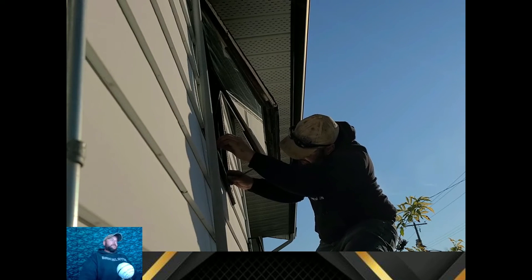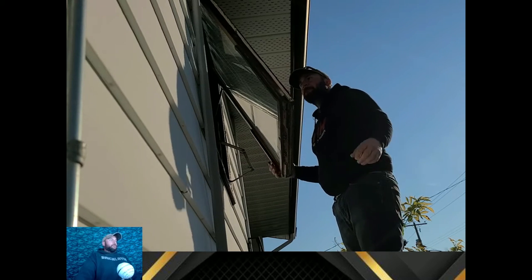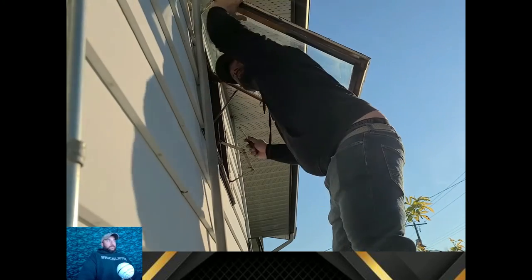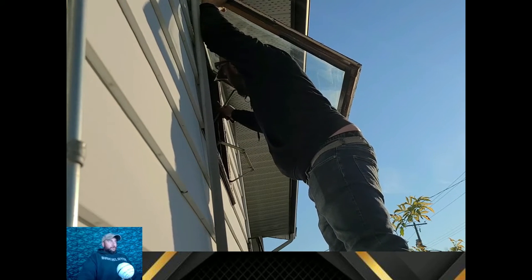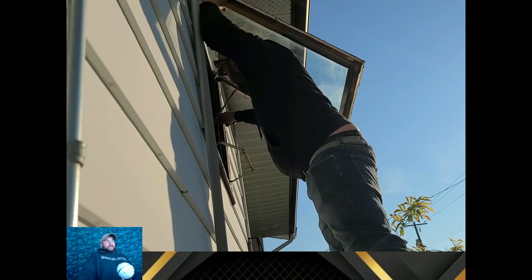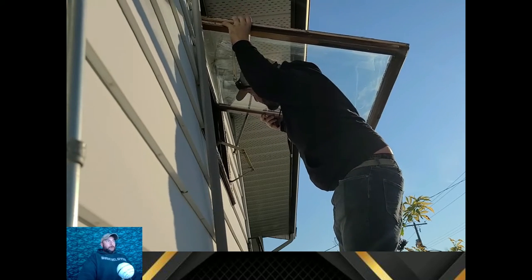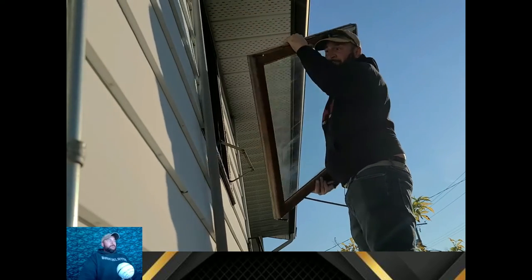I'm repairing old wooden windows that don't seem to be closing properly and may be slightly rotten. I was told these windows were pretty rotten, but in pulling them apart and inspecting them they look about 92 to 96 percent good still. They're really simple to take apart — there are little clips you need to slide up on the arms, and little tabs on the closing lever mechanism that just need to be slid out. Then the window slides down in the tracks and you can pull them out through the recess in the middle.